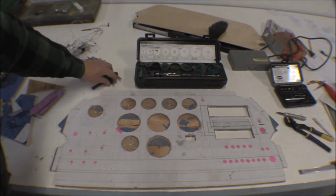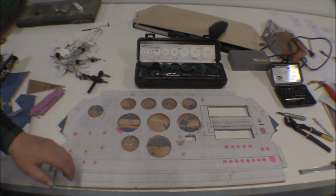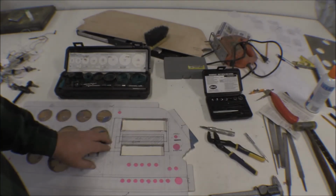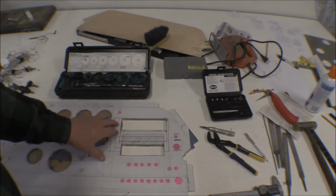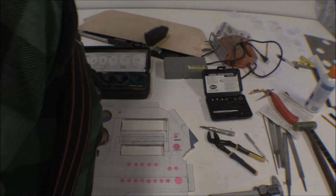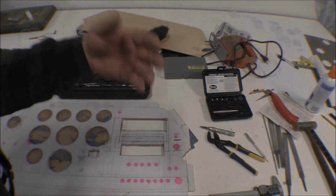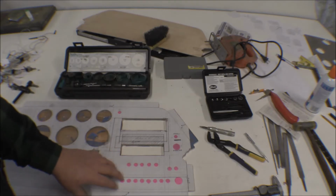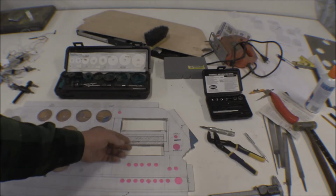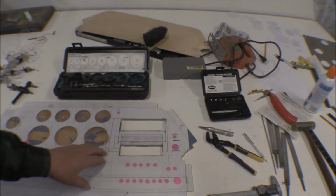It gave something solid for this pilot bit to go into to hold everything steady, so you didn't get a whole lot of vibration or anything. I've cut the holes out for the instruments. I just used a saber saw for that, and I was afraid that maybe it wasn't going to cut as cleanly because the saber saw cuts on the upstroke, whereas the bandsaw cuts on the downstroke. So when I had it on the bandsaw, it was pulling down into the plywood and into the table and made a better cut. But the saber saw was cutting up through the plywood and into the aluminum, but it cut fine. It cut real well.